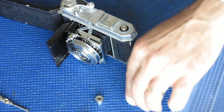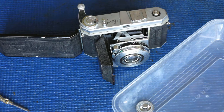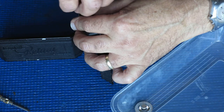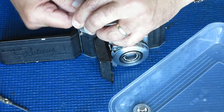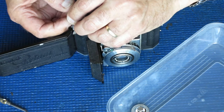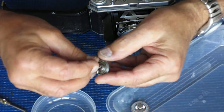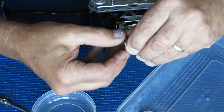I'll put my parts aside in the tray. For the advance knob, I normally just turn it a quarter of a turn, then use my pin spanner tool to undo that screw. You could use a very stiff pair of tweezers, or a pair of needle nose pliers with the tips suitably mutilated. I don't normally clean the pawl through the ultrasonic cleaner — they're a bit fragile and replacements are very expensive.